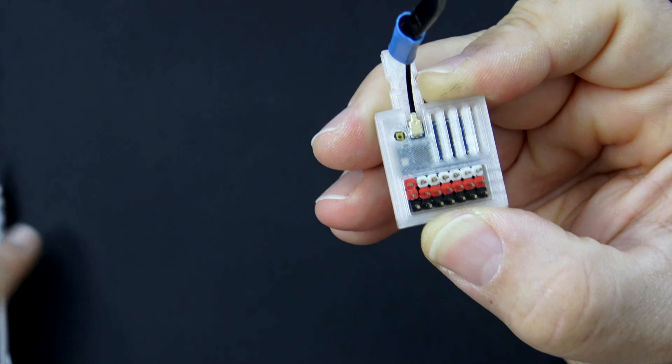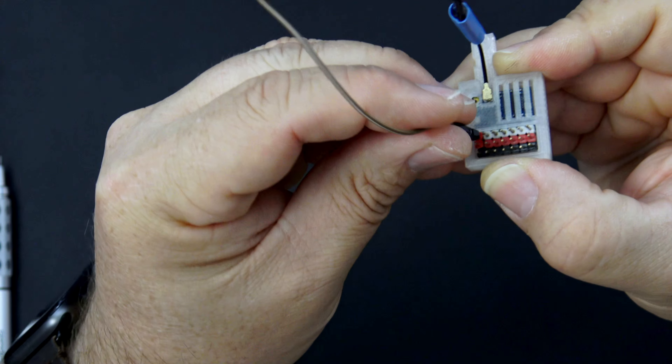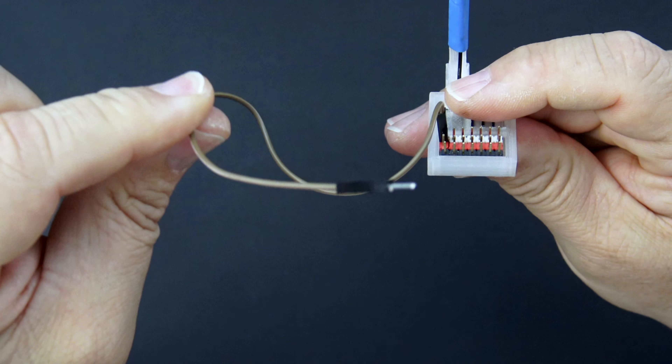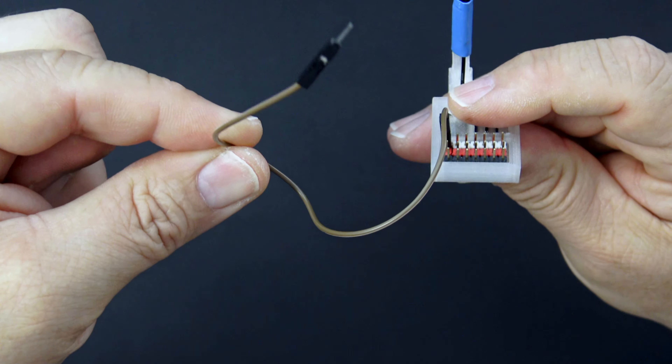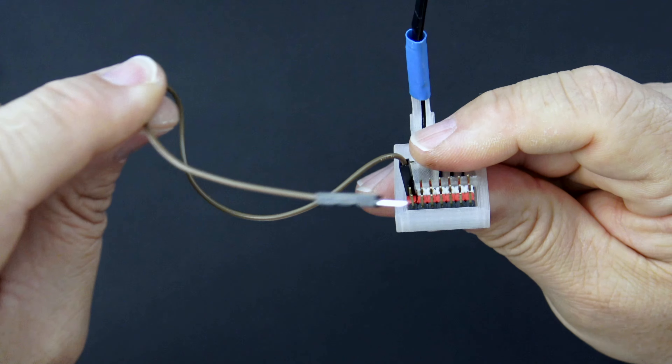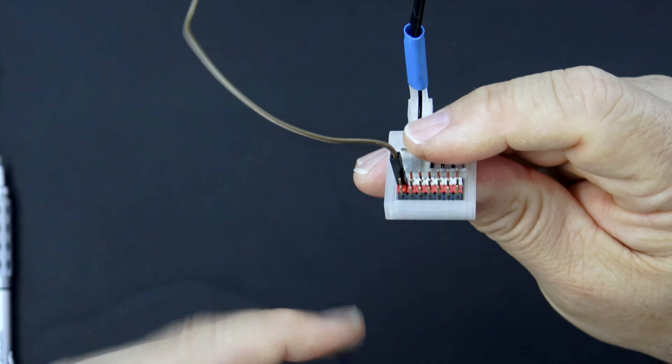I like this VBAT pin a lot — this is what I used on my jet. For now I'm just going to connect a lead to that VBAT pin, just one lead. You don't need ground, just one. This is going to go to the positive wire on our battery. We'll get into that more later — just remember single wire on VBAT, it's the very last pin over here on the left.